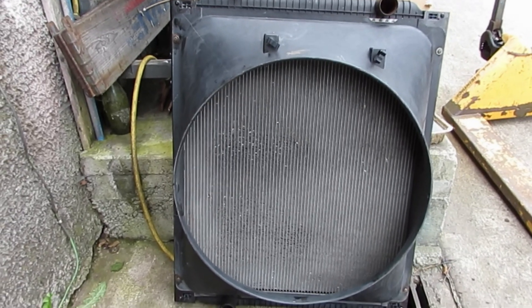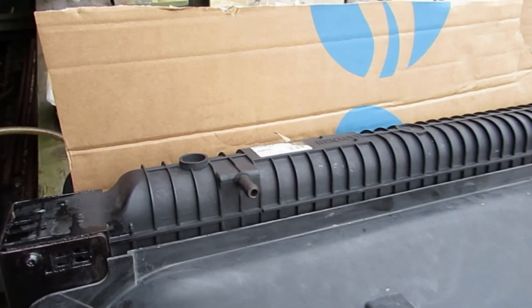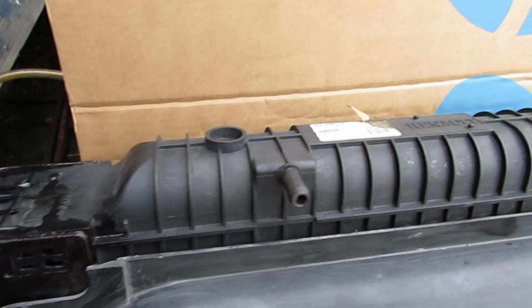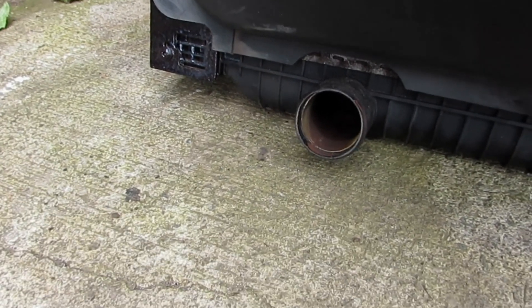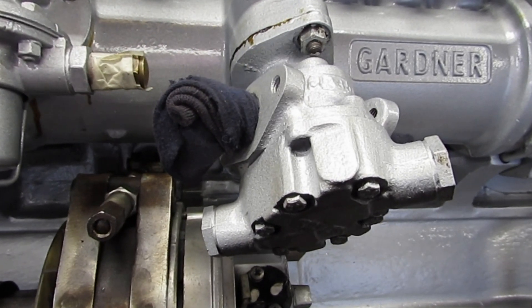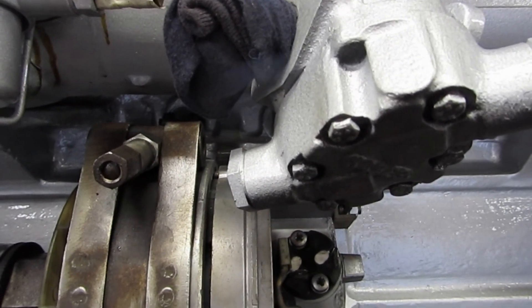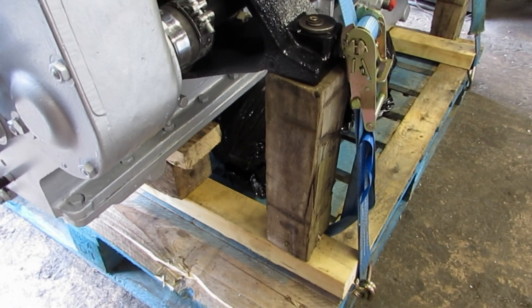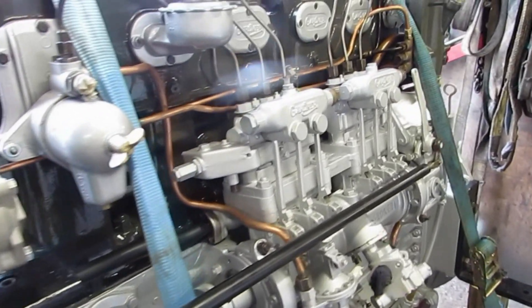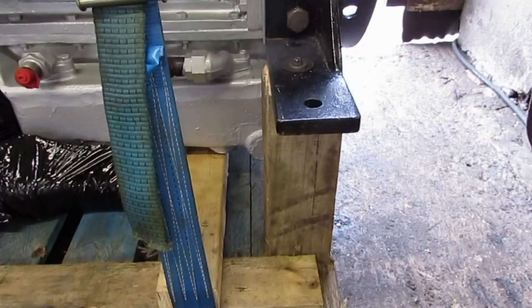The radiator that'll go with this engine — I confess it's not a Gardner radiator, it's actually off a Renault truck. On here you can see a small pipe for makeup and this will be the output from the thermostat. At the bottom here you can see the output to the water pump — the water pump will suck from here. We've got the oil cooler pump, though we weren't able to plumb that up because the standalone oil cooler will be mounted on the chassis of the truck. We decided with this engine that we wouldn't send her horizontal but would actually mount her vertical — we thought it was just a little bit unbecoming of an engine in this condition to be going on her belly. You can see where we've coupled the mounts down onto the pallet.